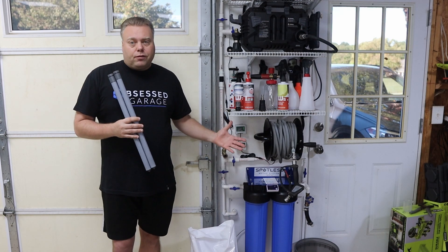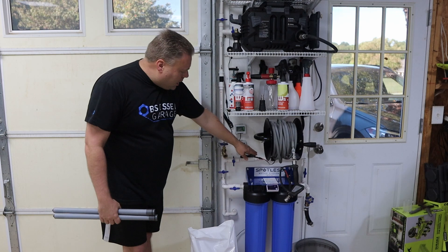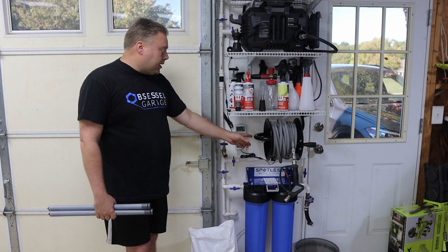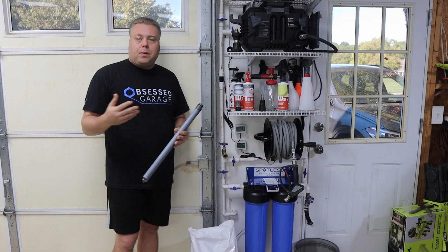Maybe it's not as good — we'll find out. A lot of people have been using this from them and they've had no complaints whatsoever. I have my DigiFlow meters right here. We have one on the DI line so I can measure the exact gallons and gallons per minute coming out of that. We hit one ppm at about 490 something gallons; they said it would go about 400 for the ppm that I have.